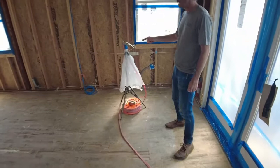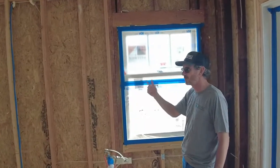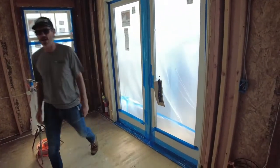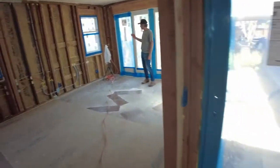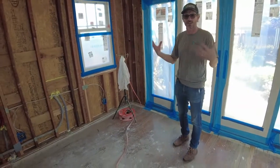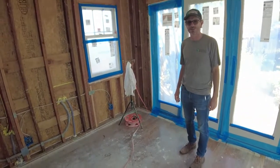We've got one spray rig here, and while we're here we can see they've sealed these windows completely. These are double-hung windows — we have a lot of them, which is going to have a good amount of air leakage. But we'll see what our leakage is before and after with air barrier, excluding the doors and windows. You can walk back into the back part of the house and see another spray rig in the adjacent bedroom, and then this one is back in this corner of the house — spraying in a cone pattern to get a good mist of the product that finds its way through the cracks.